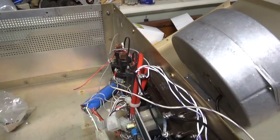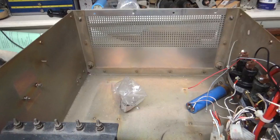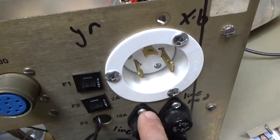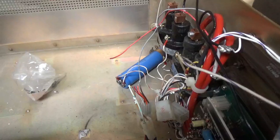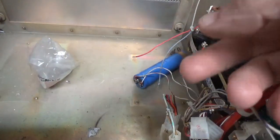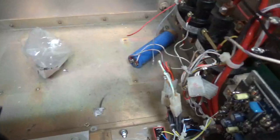If the blower stopped working, then it would shut down. The blower line is before these two fuses, and they have their own circuit breaker. So if those fuses pop for some reason, the blower would go for the preset delay-off. Anyway, it's bigger than what it needs, so that's not really needed, but it's already here so I'm using it.